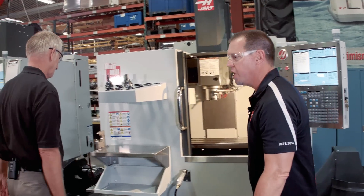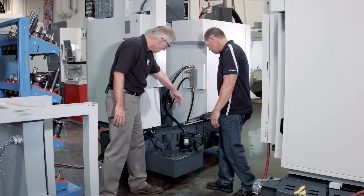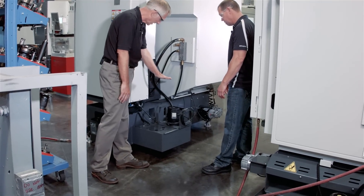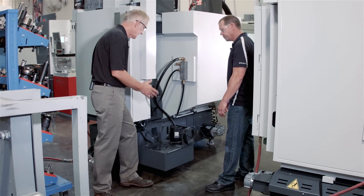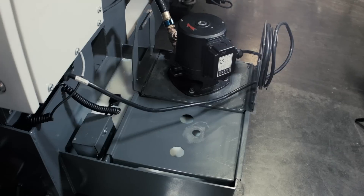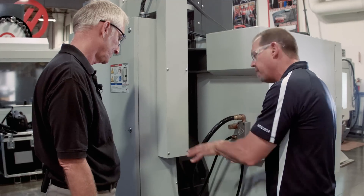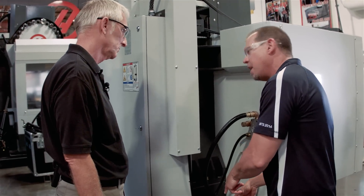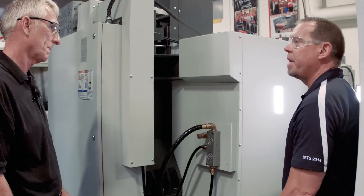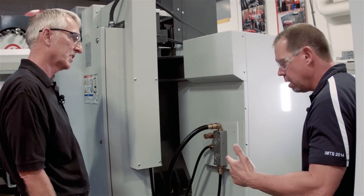Talking about coolant — let's go around the side of the machine. You guys have actually redesigned this whole section as well. We brought the back of the tank out, dropped the bottom a little, brought the coolant level up, and that's how we doubled the coolant volume. That allowed us room to put the standard tank here with a TSC side by side, or pop in our standard high-flow tank right off our VMCs. This looks a lot more user friendly — where you used to have some interferences, now when you add TSC you drop it straight down with no sheet metal in your way. We also changed how the coolant flows and how we port the coolant, and that allowed us to get rid of the filter — one less thing in the shop to check daily or weekly, one less part.